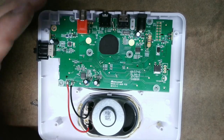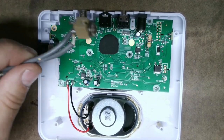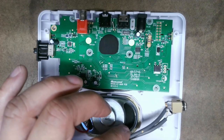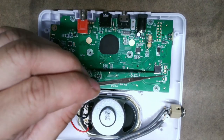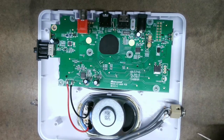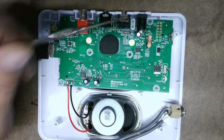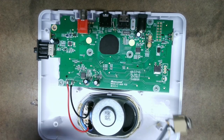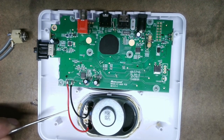You can do this a few different ways. You can take a jack — I had this one from another project — drill a hole, mount the jack, run a wire from the switch point to the jack, and one from ground to the jack. Then you can plug in a cable. Or if you don't want to do that, you can drill a hole and have two wires coming out — whatever you prefer. While you've got it apart, if you don't want to hear it over the speaker, you can also add a switch to turn the speaker off.